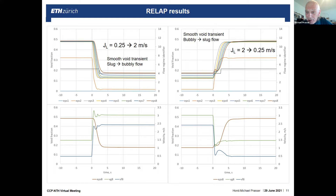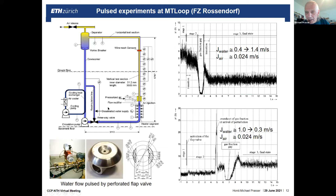As a second step after steady-state commissioning, I propose pulsed flow experiments: we perturb the flow by a sudden change of liquid flow rate. If we increase liquid superficial velocity from 0.25 to 2 m/s as instantaneously as possible — by changing pump revolutions within a fraction of a second — we will see a drop in void fraction and a change in flow regime. RELAP's flow regime identifier output shows slug flow transitioning to bubbly flow. If you decrease the flow rate, void increases as the same energy is supplied to less liquid mass, and a void fraction wave travels through the pipe.